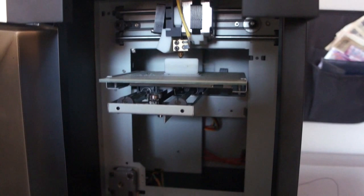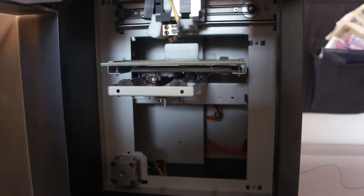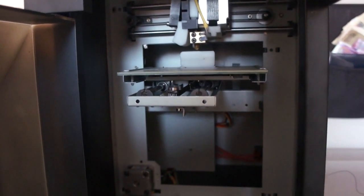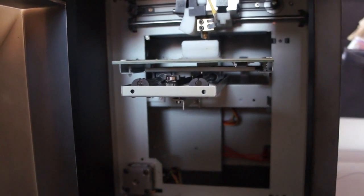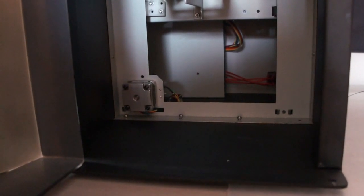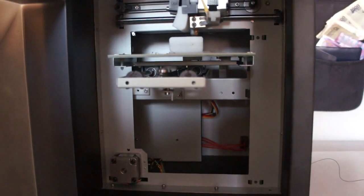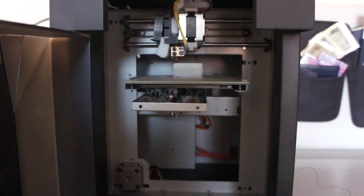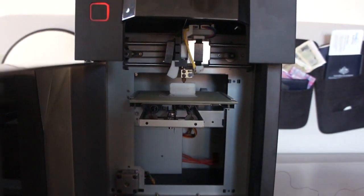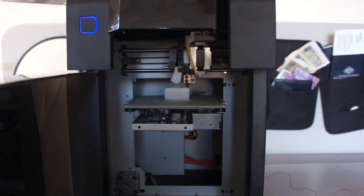Inside the printer, again all sheet metal construction. The linear bearings, linear slides, in the old printer replaced by these rods where linear bearings sit on, and it's again still belt driven. Stepper motor, PCB and the main motherboard, etc. hidden behind that metal panel at the back. I won't go into much detail just to not reveal PP3DP's trade secrets, but just want to show the construction is, it's a well engineered product.